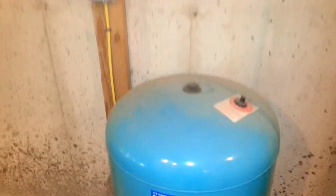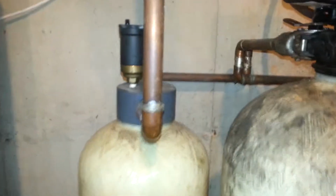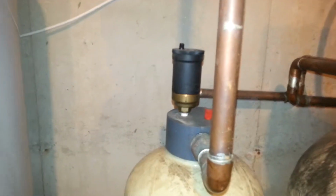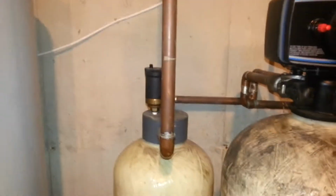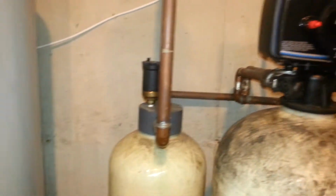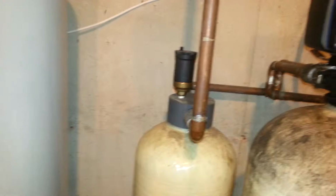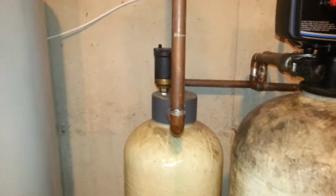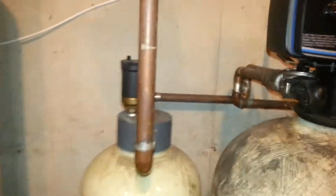And we have our well tank here. Then it goes over to a vent tank. This is the next component of this old type system. Now, this was not the worst technology at its time. I'll go over a couple of the issues that have come up with it over the years. So this is where the excess air that was not used to oxidize iron or odor or sulfur or something like that, it was all vented out through this tank right here.